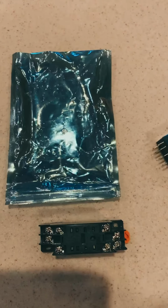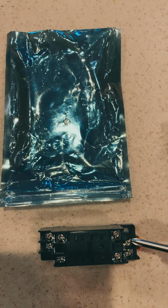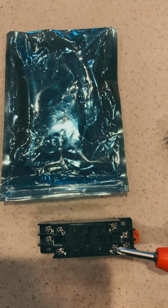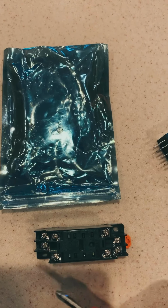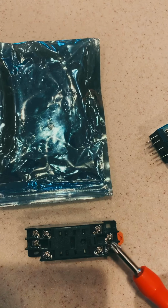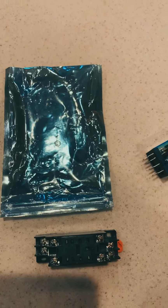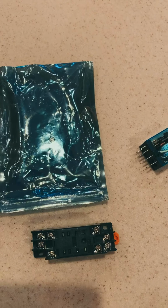What we'll do is come in to these two pins. I've seen another video online that describes the layout on this. So we'll come in from the Ring doorbell to these two, and then connect one wire of the black and green here, and one black on the other and yellow side that will be running to the Chime, so that when power comes on the Ring doorbell, it'll make that relay connection, close the circuit, and send the signal to the Chime that it needs to ring through the Nutone system.